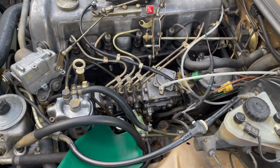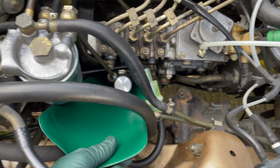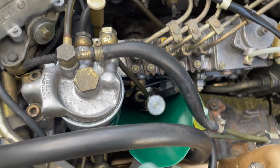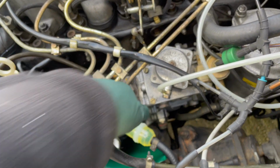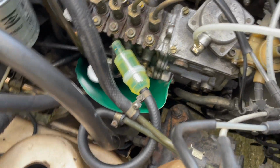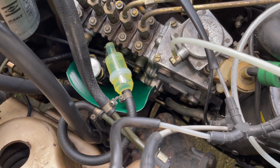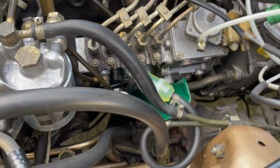And sure enough, you can put it down in here like this, and you can take it and aim it right onto a drip pan underneath, and then you can go ahead and put it underneath your pre-filter and even bend it up on this side if you want. Bend it up like that. Now when you remove the pre-filter, all the drips from that pre-filter are going to go right down into your drain pan on the ground. And you have a protected motor mount.